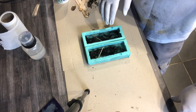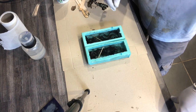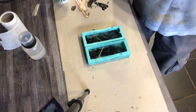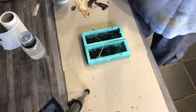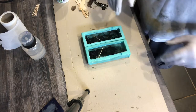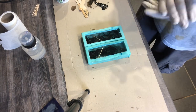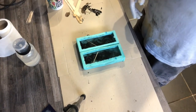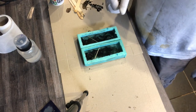As soon as the resin cures the bubbles don't come out anymore. You don't need a vacuum chamber for this, but there will be very very small bubbles — if you've got a vacuum chamber or a pressure vessel then you can get rid of them 100%. When you measure this you should get about a 20-degree even up to 100% temperature rise, so if you're at 30 degrees ambient it will go up to 40-60, sometimes even 70. If you're in a hot humid area the thermochemical reaction could get it past boiling point if you're hitting 80s or 90s — then this will all just stop bubbling and become an absolute mess. It's got to be a fairly cool, dry area — that's the ideal condition.